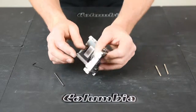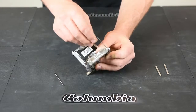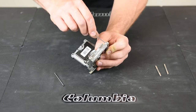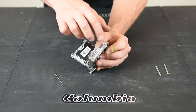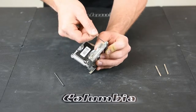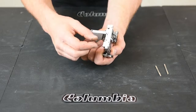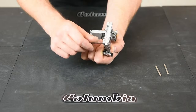On each side, where the back advance set screw is, you want it to touch the blade. Once you know it's touched the blade, do one full turn on the Allen key. Repeat the same step on the other side — touch the set screw up to the blade, then do one full turn.